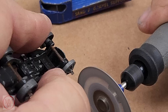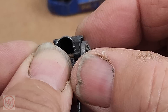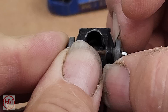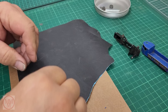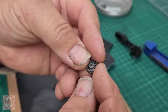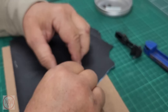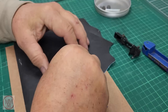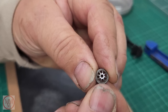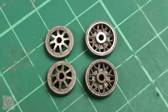I just lost my concentration for a very small split second, and unfortunately I nicked the wheel with the disc. I was really annoyed with myself — I've got no replacements. But out of desperation I did a test where I just scuffed away at the wheel on some very fine emery paper, and it seemed to work. It revealed that these wheels are very soft metal. And it's fixed — the groove I cut must have been just a micron or two deep. I managed to dodge a bullet and get this thing looking as good as normal again.